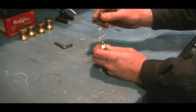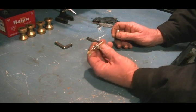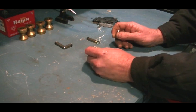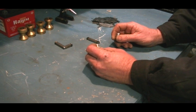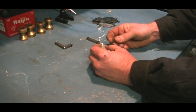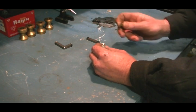Most of you will know this, some will not. It's been said many times that you need a north and then a south and then a north to get an alternating current — and that's not the case. If you have a south field approaching the coil, the current will flow in one direction; as it's leaving the coil, it will flow in the other direction.